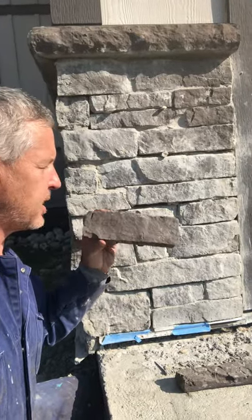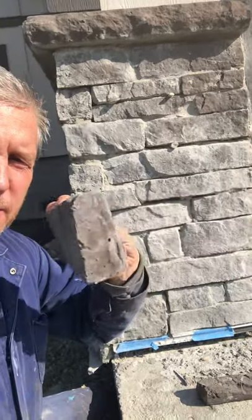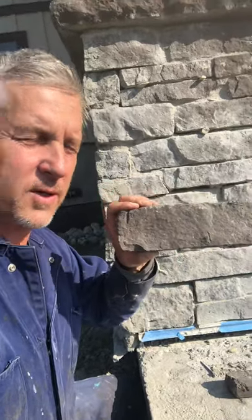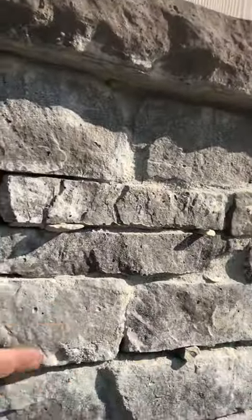There are two types of stones you're going to have to make, or three types actually. One is a flat stone like this. Notice the texture in the front. And then notice it's textured on the back. It's scored so it will adhere to the face of the wall you're building properly. And another type is a cornerstone. Notice we alternate corner pieces, long side here, short side. And then the next one is long side here, short side. Alternate them back and forth, get the corner look.